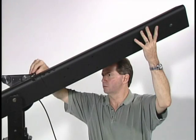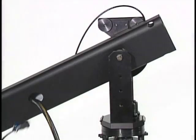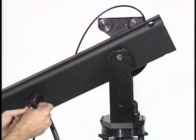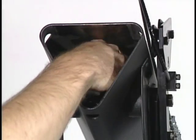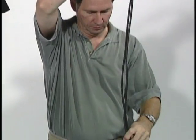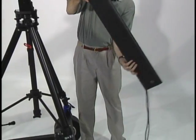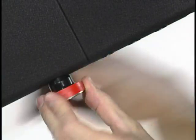You also have the option of placing the cables for the rear controls inside the jib tube. Slip the 2 ends of the Y cable for the rear controls through the hole in the side of the pedestal jib tube and out the open rear of that tube. Slip the 2 ends through the rear tube section, insert the rear section, and then secure it with 3 tapered plugs.